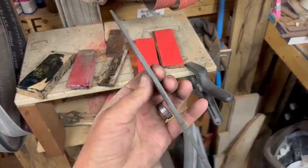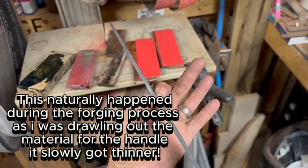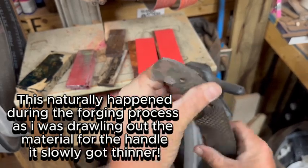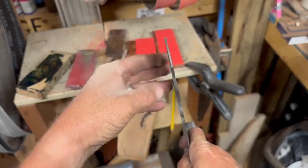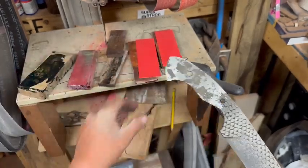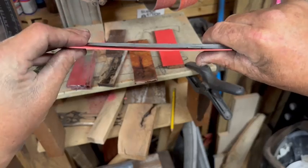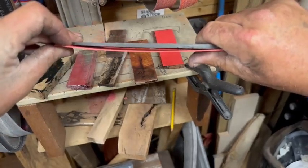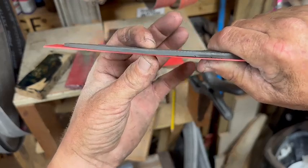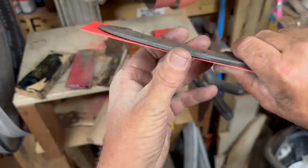What I mean by that is just the fact that part of the handle scale is going to be up here towards the front where it's thick. And then you can see that as it goes back to the end, it tapers down to a much thinner stock. So when doing this, you want to be sure that you're nice and flat all the way back. Because if you're not, and you go to glue up something that's hard and straight, that might be exaggerated, but you see what I'm saying? You might have gaps in between where it needs to be. So this is something to pay attention to if you're trying this, and you can see just by placing it up here and pinching it close that for the most part it's laying relatively flat.